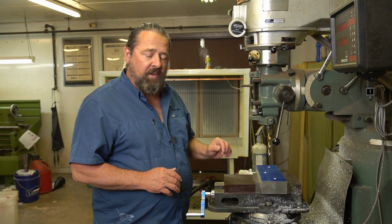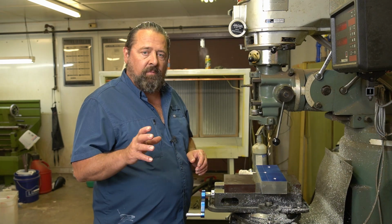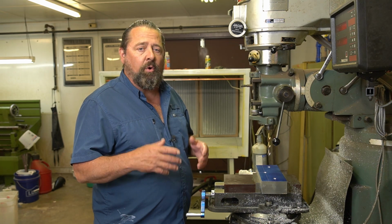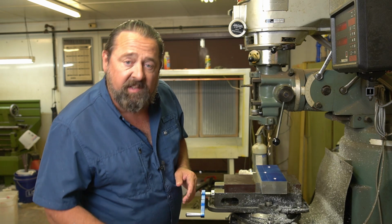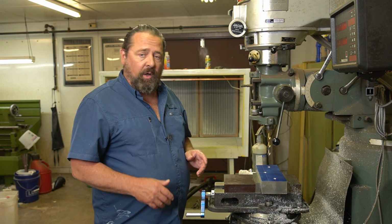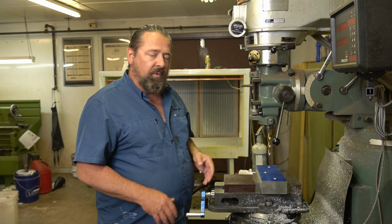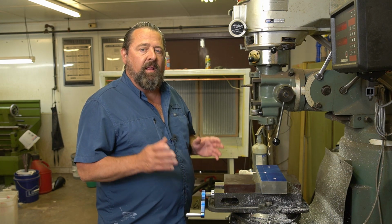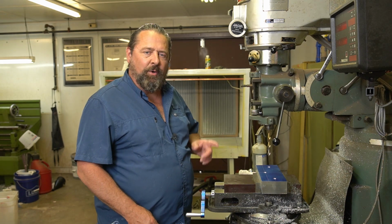Now, after the 1/2-inch drill goes through all these holes, I want to go up to 1.25 inches. The forks that I'm making these holes for are 35 millimeter, which is 1.377 in diameter. So a 1.25 inch drill is no problem. Go through that, hog all the meat out, then come back with my boring head and bore these holes. So let's go ahead and do that.